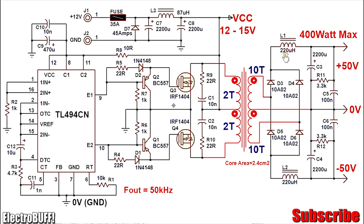Before the transformer, let's look at the output. You have an H-bridge rectifier made up of D3, D4, D5, and D6, rated for 10 amperes and 100 volts — these are high frequency Schottky diodes or fast recovery diodes. Inductors L1 and L2 and capacitors C4 and C3 filter the output to obtain a steady DC. L1 and L2 can be anywhere from 47 to 220 microhenries and will work fine, just ensure the windings can handle at least 10 amperes.